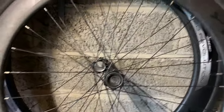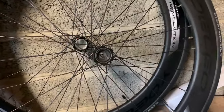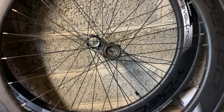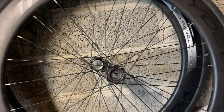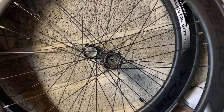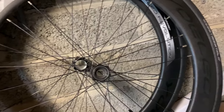Things I've learned from this: get a bigger hammer, because the little tiddly rubber-face hammer I had really didn't cut it. I've also ordered a nylon face mallet for next time. I was a bit underprepared — I'd never done it before and didn't realize how much effort would be needed after having the bearings in there for so long.